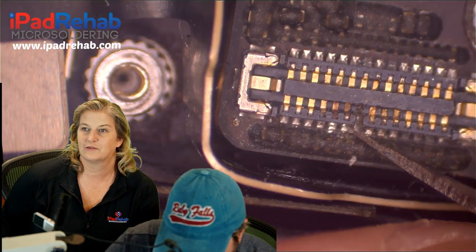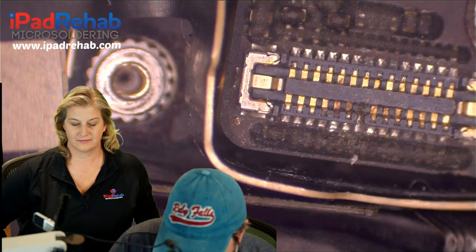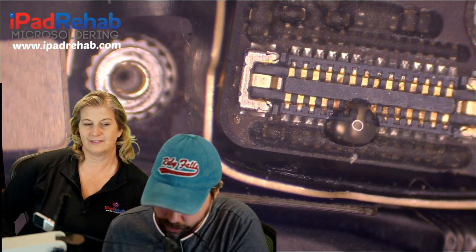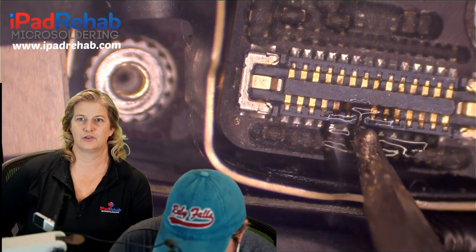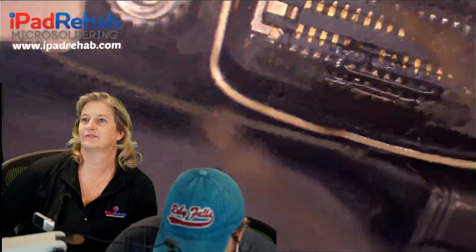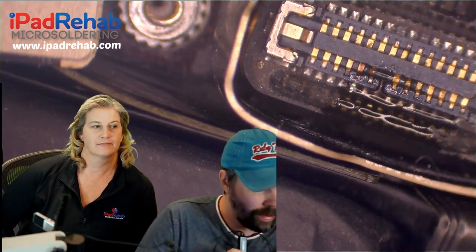Let's watch what Mark is doing. He's cut away the plastic and is now lightly using a razor blade to get some of the corroded gunk off of the pad. Now he'll add some flux and touch it up with an iron a little bit. Now you're going to get rid of the little nubbin that's left — it pretty much disintegrated when he touched it — just prepping that pad for the new connector pin.